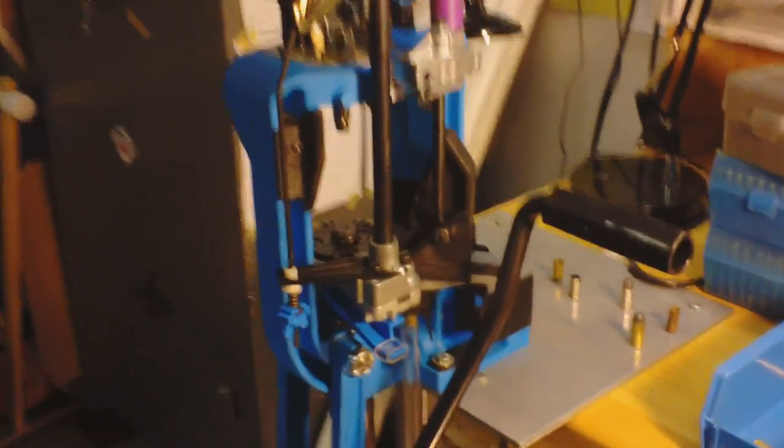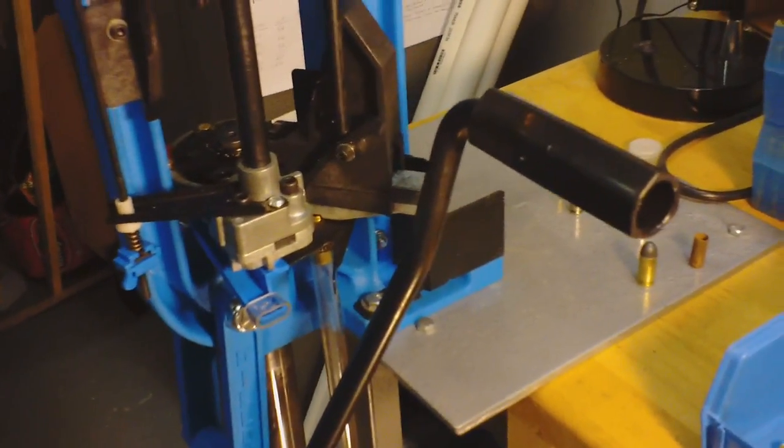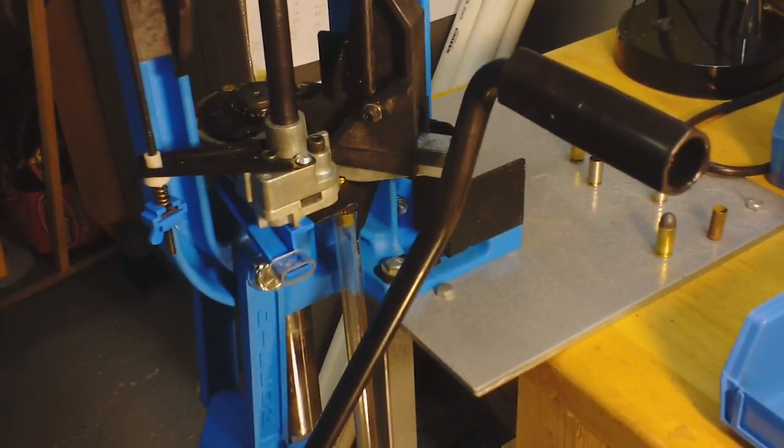Now, as you can see, I've got this much overhang on the bench, like 5 inches overhang. Before, if I just had the press mounted to this, when you pull the lever, you'll definitely bend that tabletop. So when you mount the press to a plate like that, and use the pedestal to support it, you'll get absolutely zero flex. A lot of guys, when they do this 650 setup, use this strong mount, which lifts the press high off the bench, almost at eye level. I prefer this way because I like sitting down when I'm pulling on the lever.